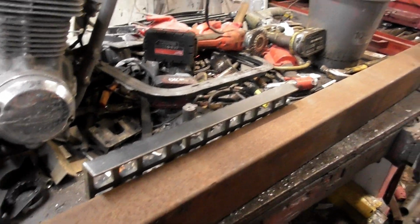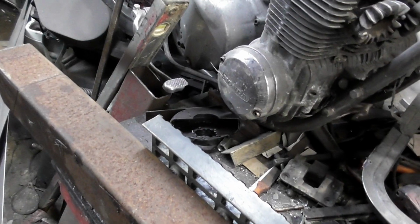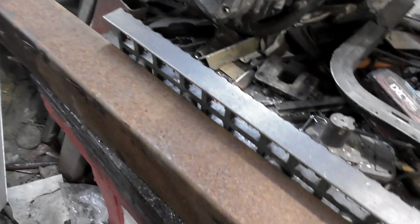But what I will do is cut out a steel plate. I've got a lovely thick bit there, but that's going to be a nightmare to cut. I do have my angle that we spoke about down there. I do have this, but I have a job for that and it isn't thick enough anyway. But we'll make up some plates to be bolted in, either 2 bolts or 4 bolts, I don't know yet. And then we'll bend a piece of metal to go around and then back down again. And what I might also do, more of an afterthought than anything, I might put a piece of angle iron along there as well, and then put a piece of tin over the top with holes drilled in it. I don't know about that at the moment. I haven't made my mind up yet. I have been debating about drilling random holes in the side of this, just for tidiness, but I'm a little concerned it might put a bit of a weak point in there.